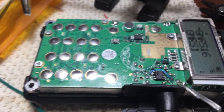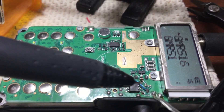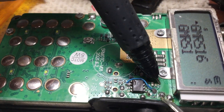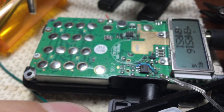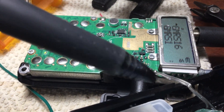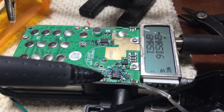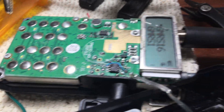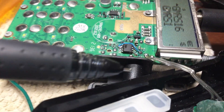Good news — we got the wire on there. To isolate this connector, I removed the surface mount components — one here and one here. Like I said, I'll post the schematic. This is the UV5R. I could probably unsolder my speaker wires, but I don't want to do that because this is going to be my test radio and I want the wires hooked up for the speaker for other experiments down the road. So we took pin two and went to this terminal, which feeds it out of this plug. And I've got my meter hooked up.